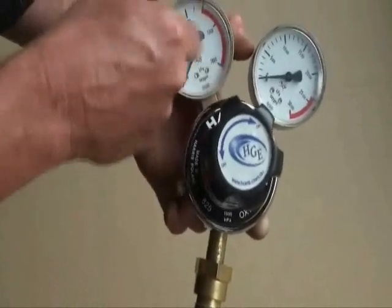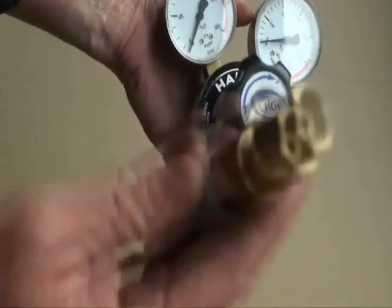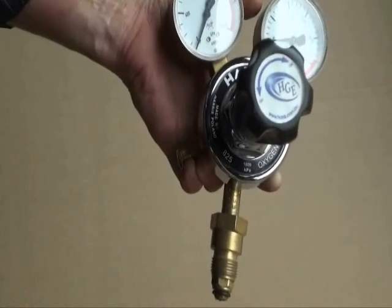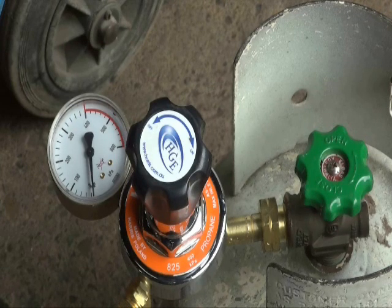The Premium kit comes complete with rubber hard hats on the 63mm face gauges. A flashback arrester is also included in both kits — for the Oxygen and also the LPG. The 825 LPG regulator also has SnapSafe fitted, is 0–400 kPa outlet, and is a high flow regulator capable of delivering sufficient gas for all the Harris heating range.